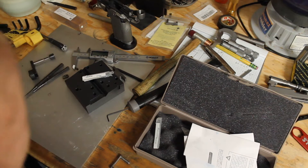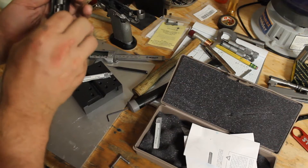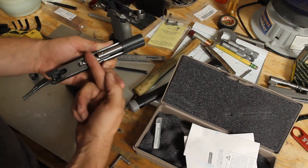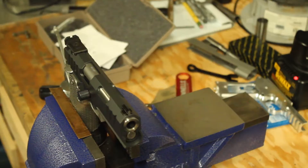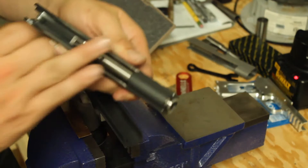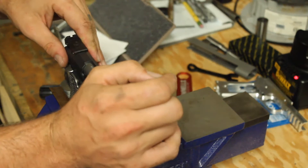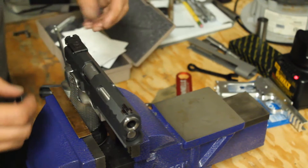The barrel's in there, it's not going anywhere. I'll check with my barrel alignment block to ensure it stays straight. The barrel is now straight, which is important because we need the lower lugs to be cut straight — if they're not cut straight we're in for a different type of hurt. Now that we're set up in the bench vise with my slide assembly on my frame, slid as far back as it's going to go, I've got my cutter in my cutter handle.